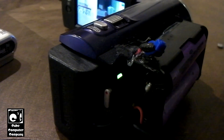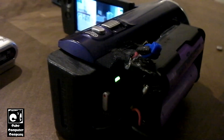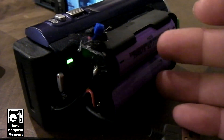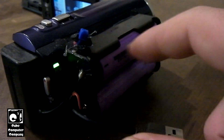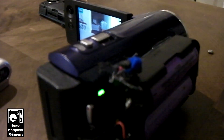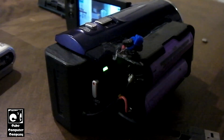Now the crazy thing about this camera is, because it is 18650 modded, the way you change batteries in this thing is kind of funny. When you change batteries, you swap out the two cells with fresh ones and then you have to briefly plug in this to a USB port until this light comes on, which indicates that the protection circuit has awakened from sleep, and then you can disconnect it and use the camera as normal. But yeah, in the case of it being a stock Handycam, you'd have just a battery pack and any time you would take the battery pack out, it would lose track of everything.